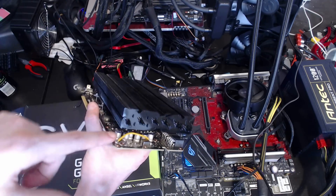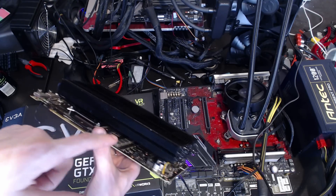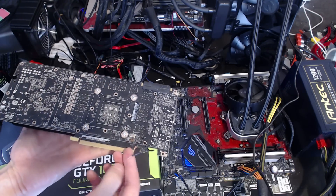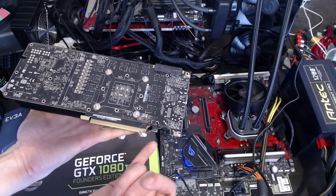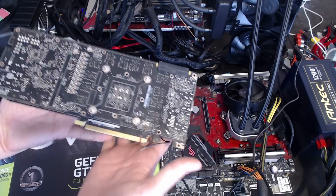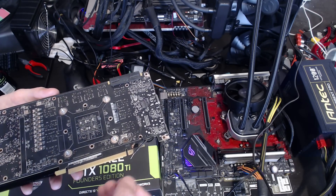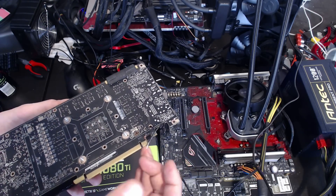That's great, because that means I don't actually have to do anything difficult. The short circuit is probably around the area of the PCIe slot that blew up. I just need to supply 12 volts power to the VRM because it's no longer connected to 12 volts. So this yellow bodge wire pulls 12 volts from the 8-pin over here and feeds it into the VRM, so the VRM is still happy and fires up. The situation with the PCIe slot is that there are four or five pins on the end of the connector that are gone — they got literally obliterated. I didn't need to cut this off; this just sort of crumbled away as I was digging into it trying to see if I could fix the short circuit.